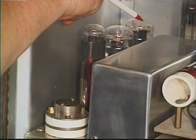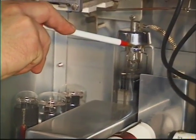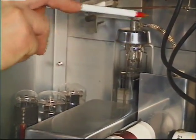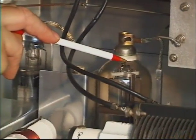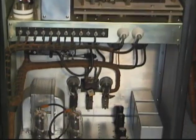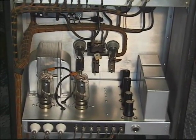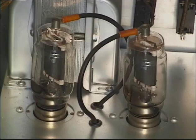An RK20 intermediate amplifier fed the power tube, a Collins C201. The speech amplifier was built on the modulator chassis and was designed to accept the recently introduced crystal microphone. Yes, a D104. The modulators were RK31s, with 830Bs as alternates, operating Class B.